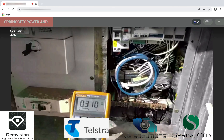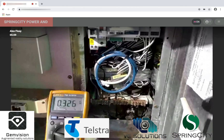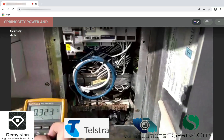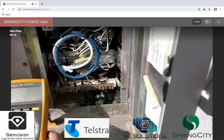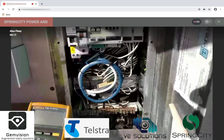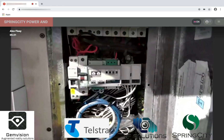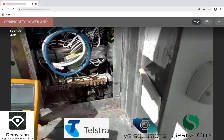Into the house to the light circuit, so I'm going to guess at this stage it's probably something internal, maybe within the switchboard. Let's start there. Generally in this case it may be a loose neutral wire at the neutral bar.